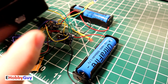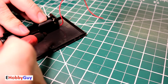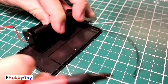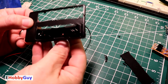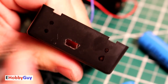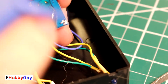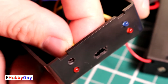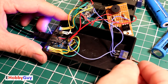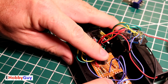I'll disconnect the power and see if we can squeeze everything into the enclosure. I'm going to elevate the two batteries and get the boards underneath, mount the LEDs, mount the switch, and see how it goes. First, I look at the cover and mark two rectangles representing the two battery holders — the batteries will be elevated through the top of the cover — and cut out those two holes. Next I drill a quarter-inch hole in the opposite end for the mute switch, which fits nicely. Then I drill four 1/8-inch (3mm) holes for the four LEDs. I glue one charging module into the enclosure for the power connector, then glue the four LEDs in place. Plugging in confirms two blue LEDs — everything is good.